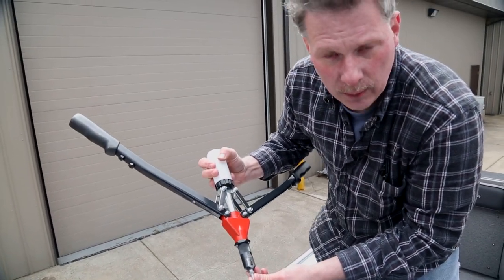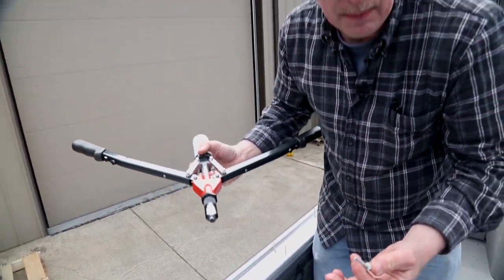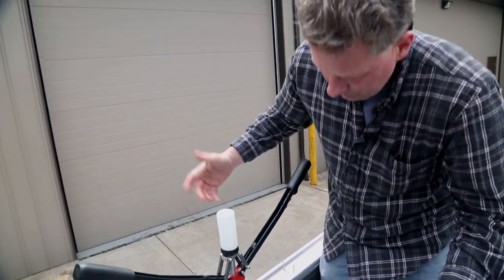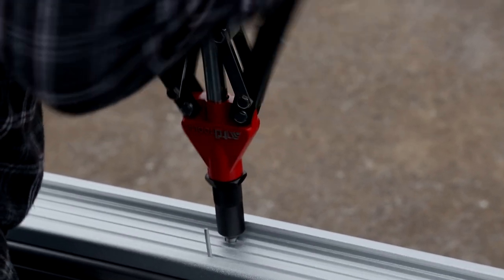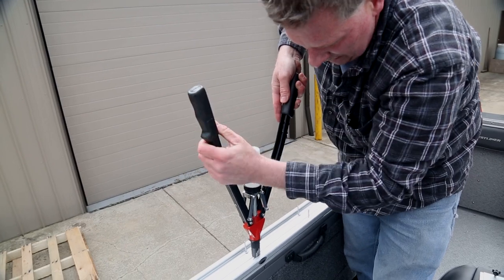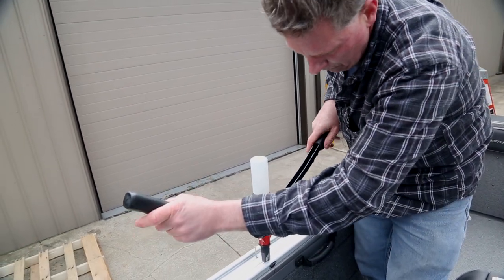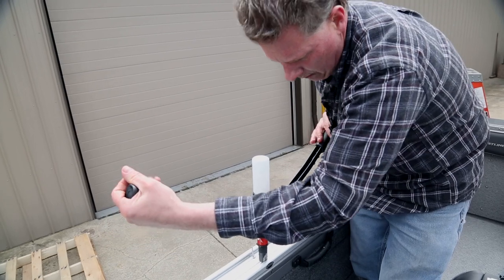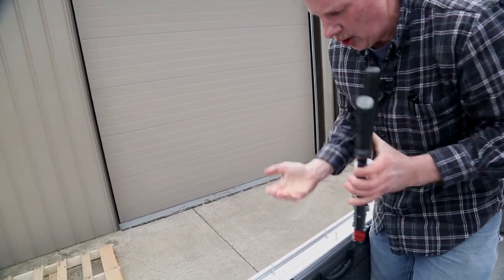A couple of things really important when looking at a rivet gun: this is just a simple handheld double-arm rivet gun — you buy it for about 50 to 60 bucks at most freight stores, Harbor Freight, places like that. So because the rivet sticks up just a little bit, I put it down inside there, hold it nice and tight, start pulling it up just enough to get it off the floor, then drop back down inside there again. I open my arms with the rivet gun, push down nice and tight, forcing down to the bottom. Then I grab hold of that and pull it up tight — and now she draws it up nice and tight.